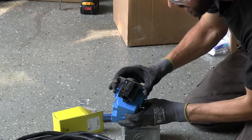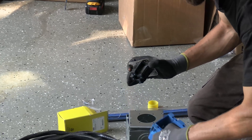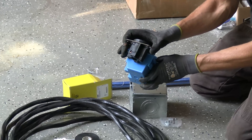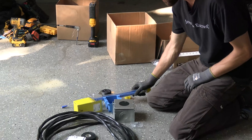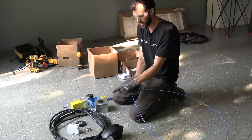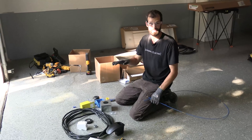This box has incredible depth, which is great when mounting an EV 14-50 receptacle because it fits really well with lots of wiring space — but that's for surface mount applications with conduit. Today we're using the two-gang remodel box and putting all the wiring inside the wall for the cleanest installation possible. The only tough part is the outlet almost completely fills the box, and by the time you add three six-gauge conductors plus the ground, it's very snug. We're using fish sticks to fish the wire down the wall — coupling a few together with a fish hook on the end makes the job a lot easier.